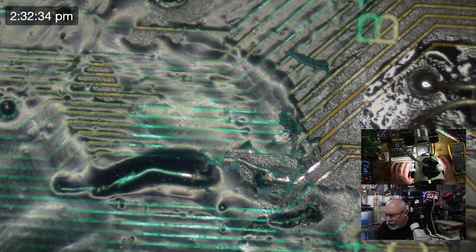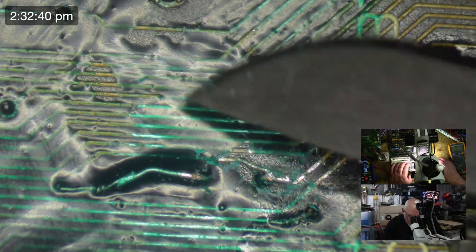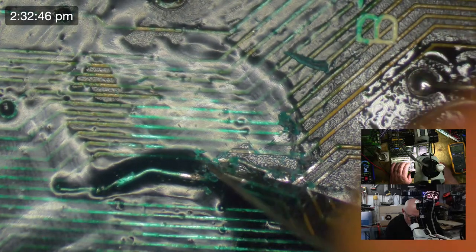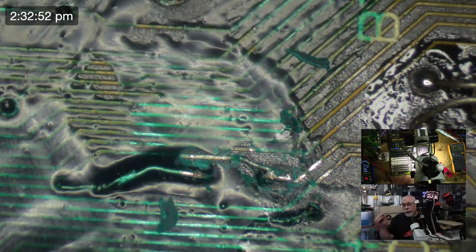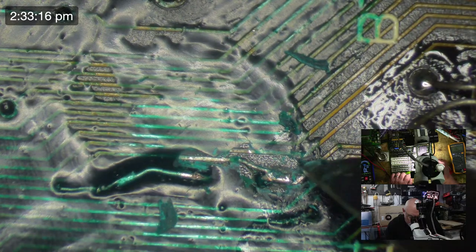What are the odds the cleaner messes up something under solder mask, though? The odds are pretty slim. But there is a really important factor I need to mention to you, Jay. I didn't UV mask it, then test it, then clean it, then test it again, which is a mistake. I appreciate that. I UV masked it, then cleaned it, then tested it. I could have stuffed something up while UV masking it. That's what I'm thinking is possibly the problem.